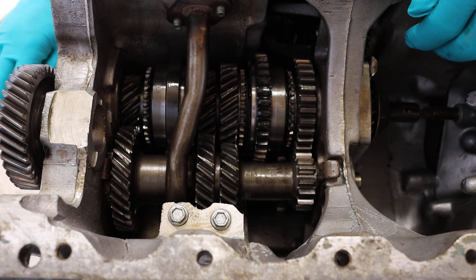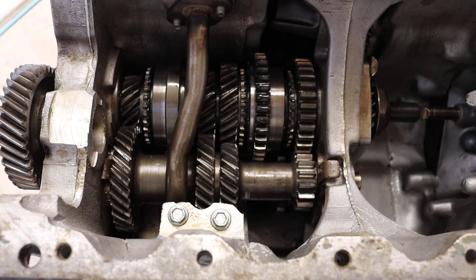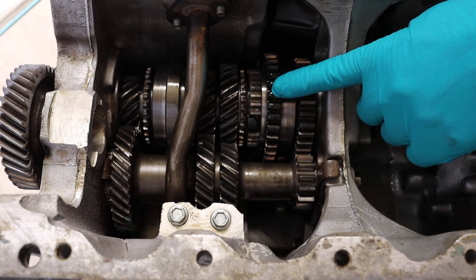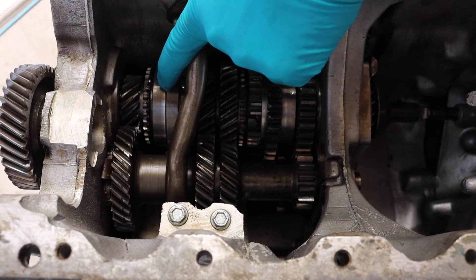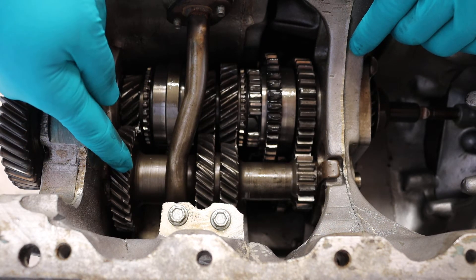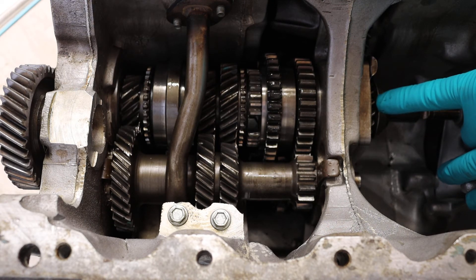I'm going to put it in first gear. The way I do that is the input gear selector needs to be turned fully anti-clockwise and then pulled out. When I do that it engages this synchroniser — this is the one-and-two synchroniser — and what that has done is locked this gear onto the output shaft. Both synchronisers are linked permanently on the shaft. So now the input is coming through the first motion onto the lay gears and it's the gear at the end that is being used and locked to the output. The output drives the differential. So that is first gear.